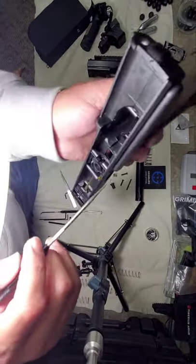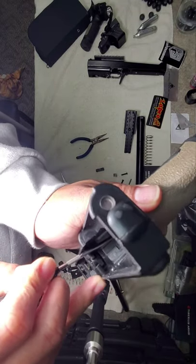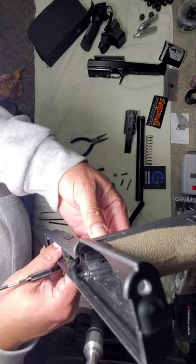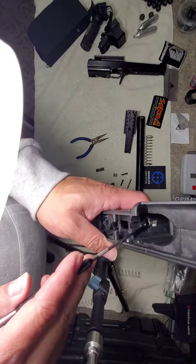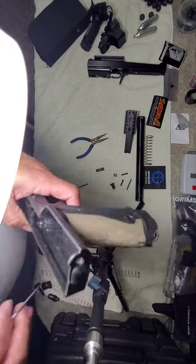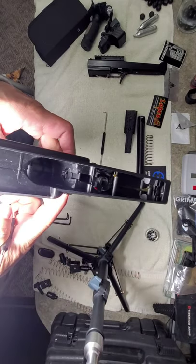It's getting caught up — luckily I have this pick. Down in here where the body was glued together there's some glue — I'm not sure if they use epoxy or not. But since the spring wasn't designed to bend this way, it was free to flex in the other direction but flexing this way it ran into this blob of epoxy. So I'm actually going to take this out, clean that epoxy, and then redo it — I'm going to pause the video just a moment.